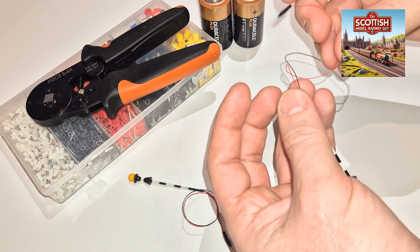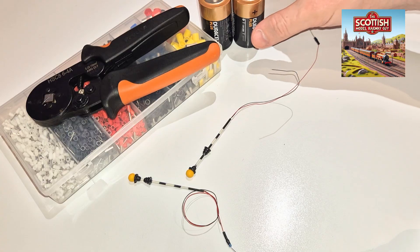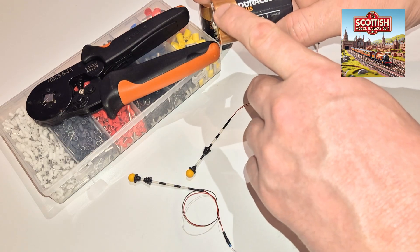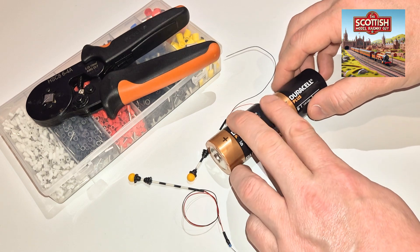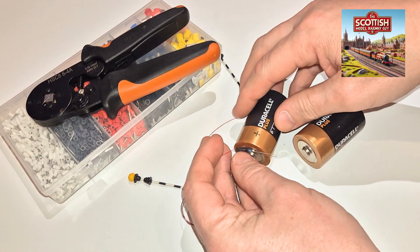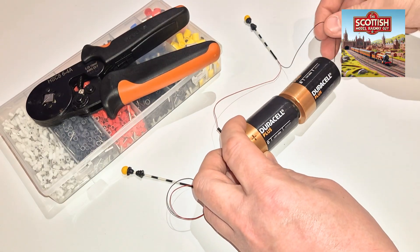So I'll show you what I'm talking about when I unwind the little fella. Each of these batteries is 1.5 volts — you can see that, 1.5 volt, positive up there. Adding two together in series would give me three volts. So what I did was I got the red side and just held it against the battery like that, on the other side, and then did this.